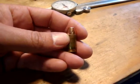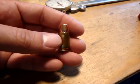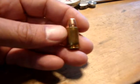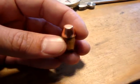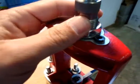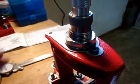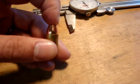Now one of the first things that we want to look at is this crimp now that the bullet's in there. You want to feel it. You want to make sure that it's not overly sticking out. We're just trying to prevent the brass from sticking out. With this style of crimp, we're not trying to press the brass into the bullet. So if you want to tighten the crimp on it, make it a little closer, you're going to have to thread the main part of the die down. If you want to loosen it a little bit, you're going to have to thread it out just a little bit. And you want to do this one first, because if you adjust this one, it will affect your bullet seating. So after you got the crimp where it's satisfactory, then you're going to want to start checking your bullet seating.